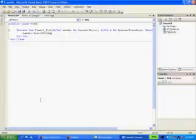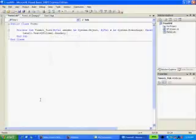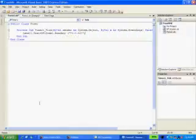And we're going to type df1com1.ReadAny, and then in parentheses we're going to put quotes, T4:0.ACC and close the quotes, and then close parentheses. And we're now ready to run the program.